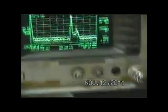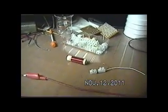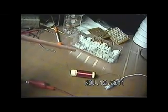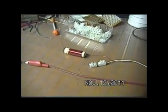Let me go ahead and make a change now to this system. What I'm going to do is take another L3 — or another coil. I'll call them L3s, because at least we have some commonality there. In here is a little 1N4148 diode, and this is just a pigtail that I'm going to hook the ground to.